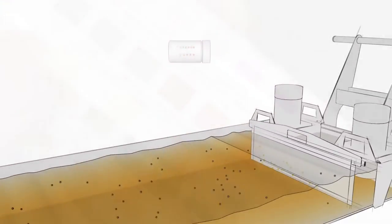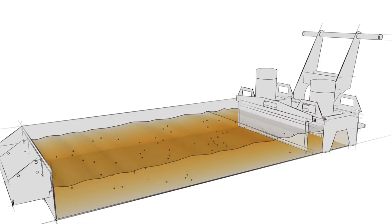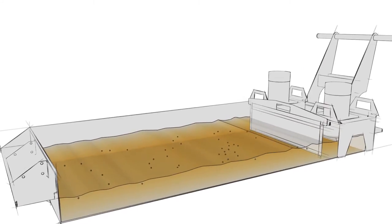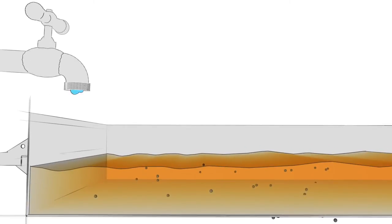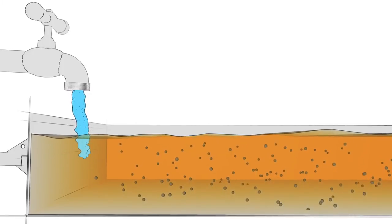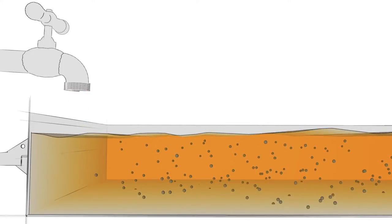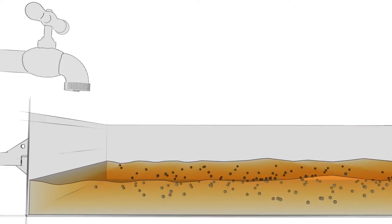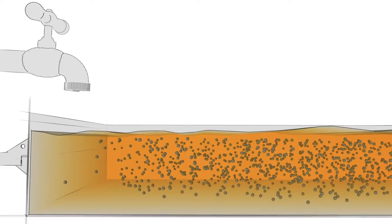So how does the coolant get to a high hardness level? Over time, the water in the coolant evaporates away. But if tap water is used, the hard minerals in the water do not evaporate. Each time you top up the tank with tap water, a new batch of minerals is added to the mixture. After a few rounds of this evaporate-and-top-up cycle, you've got a tank packed with minerals and your coolant may be ruined.